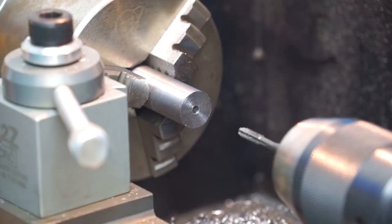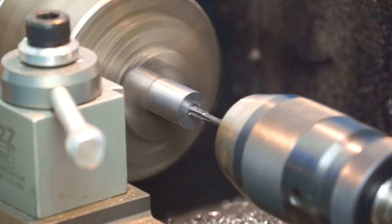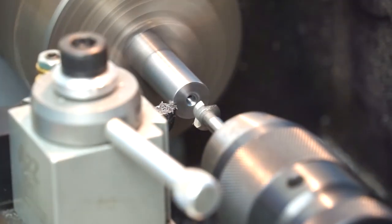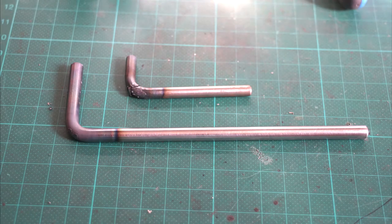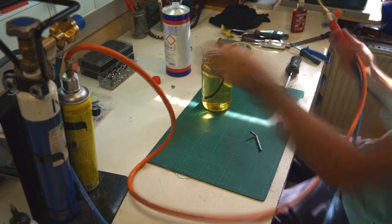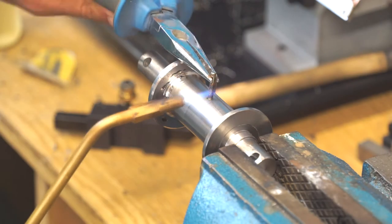Make two parts which hold the main holder together. The winding arm and drum blocker I make from 5mm and 6mm steel round bar. Then protect it from rusting. Make the hook on the drum with an empty screw and a bit of heating.